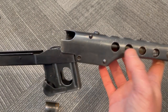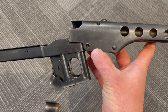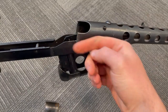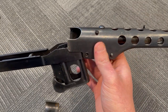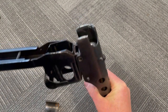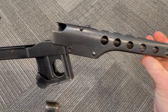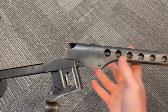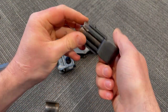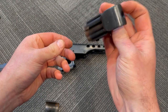Once you get that pin driven out — from the top down is the way I believe it's done — take your barrel and pound it out backwards as far as you possibly can. Then I take a sawzall, zip the barrel stub off, and pound out the rest of the barrel straight out the front. That'll get all the barrel pieces out. The front piece should be fairly easy and pretty much pound out as it is, though it might be a little stuck with some weld slag.